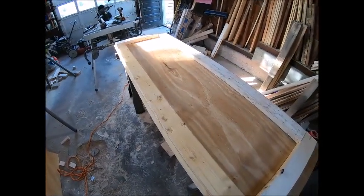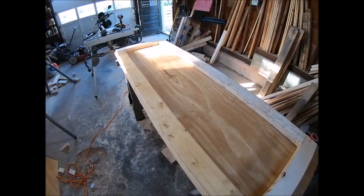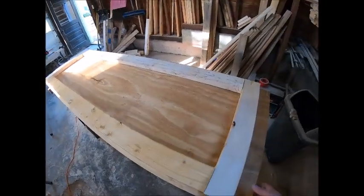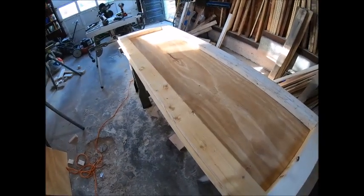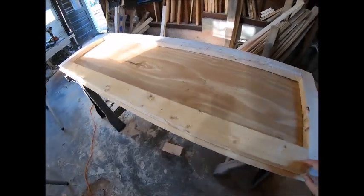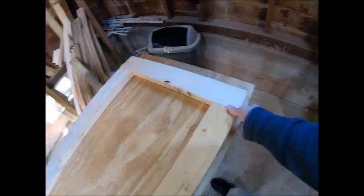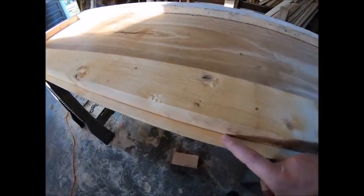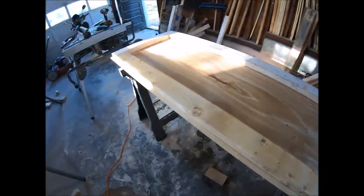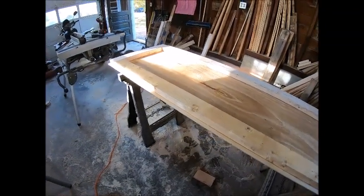I do have to run to Home Depot to get more wood. I just really need like 2 more 2x4s and I can finish this thing. So yeah, I'll get this screwed down though, and at least the framing part will be done, and then I have to rip my trim boards again in the table saw. But yeah, so this will just get 1.5 inch exterior grade screws going through it. I'm leaving about a 3/4 of an inch, 1/2 inch on each end, mostly just so it has room to expand, open and close, things like that.